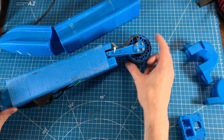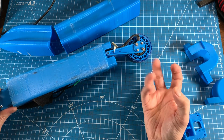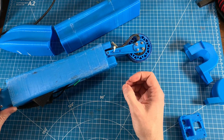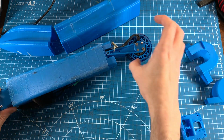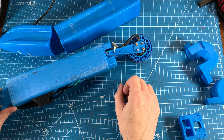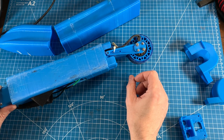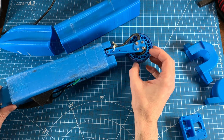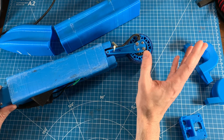That's going to do two things. One, it's going to make the whole tire and wheel assembly more flexible. The plastic has a self-dampening property to it, which is going to be really good for the fact that I have all this mass that I have to figure out how to dampen. Nylon is going to be very impact resistant, but at the same time, the lighter I make this, the less centrifugal force I'm having to deal with shredding the whole thing.